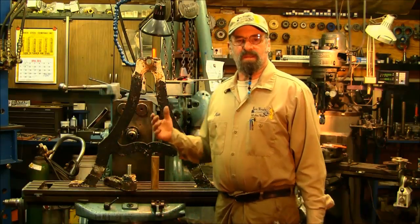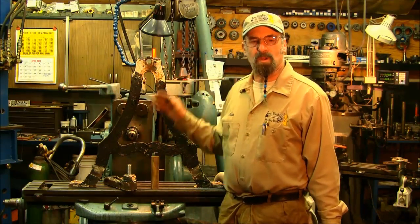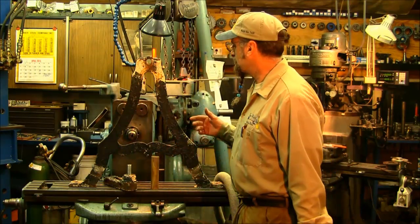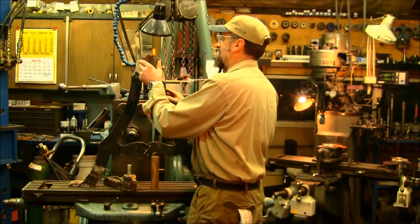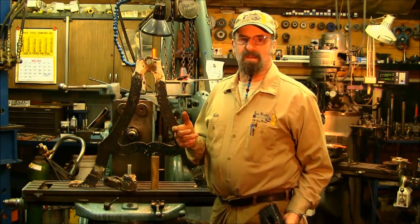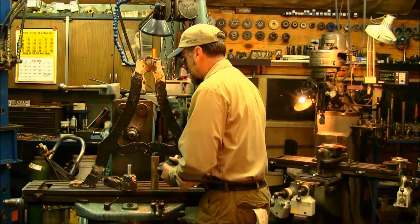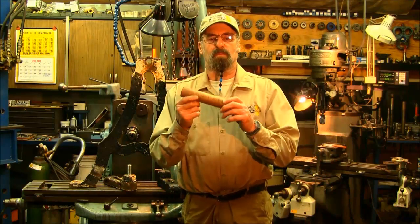Alright, we've got our 2 mills kind of cleared out. We got this set up. Tomorrow morning we're going to start in on part 2 of the video series here. We did complete both trunnions, and I'm kind of just looking in here. We got about 200 thousandths up and down clearance, and probably side to side about 1/8 of an inch there. We're going to go ahead and make 2 oil-lite bushings that are going to set in there.